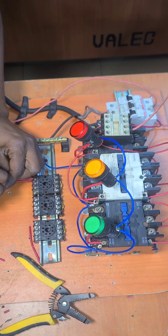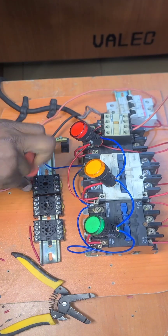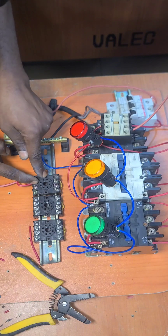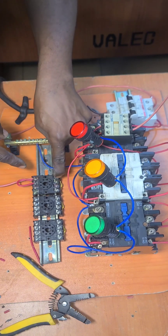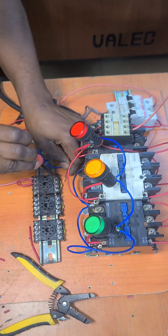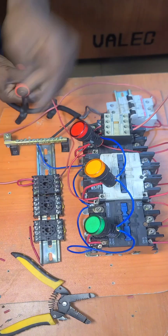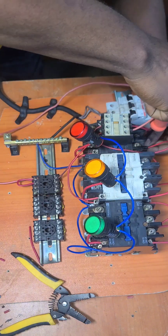We bend the wire neatly, slack out the common terminal pin 8, and insert the wire. When there is power on pin 7, it runs through pin 8, and after the delay it moves from pin 5 to pin 6. So whatever signal you have, you get it from pin 6 after that delay. To complete it, we take a wire from pin 6 — the normally open of our timer — and return it back to A1 where the original wire came from. Insert and lock it up.